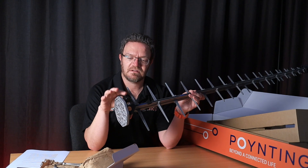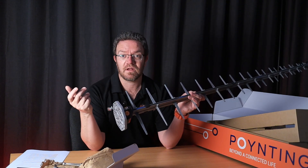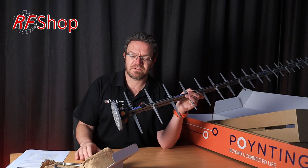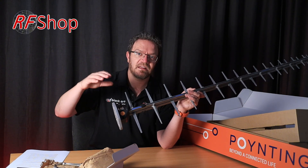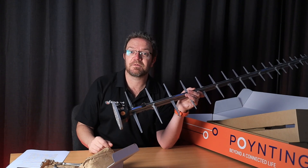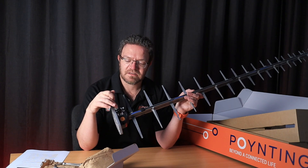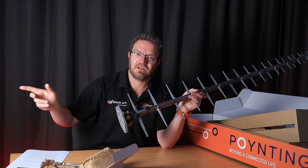The antenna does not come with cable, which I believe is a good thing, because you're not locked to a specific cable length. For installers in a big mining installation or similar, remember you'll need cables. Companies such as RFShop can make cables exactly to your specification — for instance, if you need two or four antennas for a MIMO setup, they can make cables exactly 5.2 metres long going to your modems. For the RUTX50, RUTC50, and the Alpha modem, they all come with SMA connectors, so you'd get an N-type male to SMA male cable.